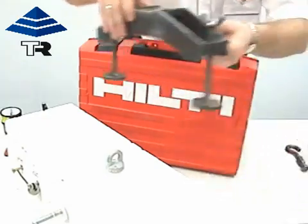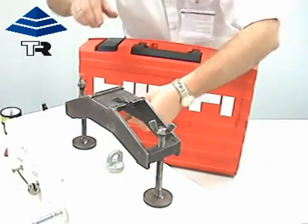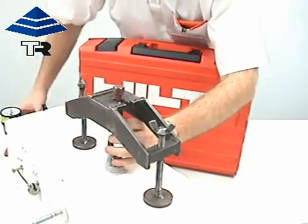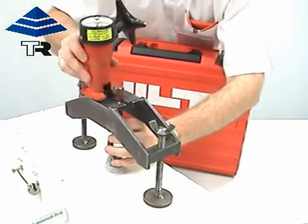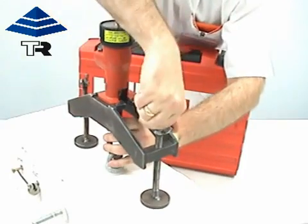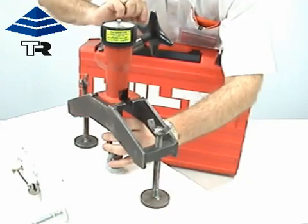We get the bridge and straddle that across the actual safe ring itself. We have the safe ring hook which clips into the safe ring and over the bridge, then we come along with our Tester 4 and simply hook that up, take out the slack in the bridge, zero the dial, and we are ready to test. Simple and easy to use.